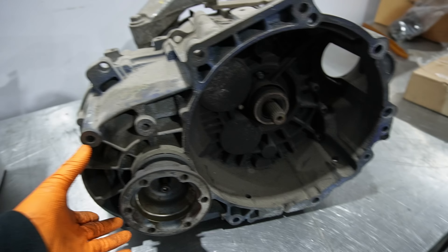We also got the last modifications to the case, which are the bars. Those are already in the case because we already drilled the holes — we found center and drilled through. When the other side of the case is together, this plate is going to go on the outside of the case. It goes like this, all the way through, and that's going to prevent the case from splitting apart.